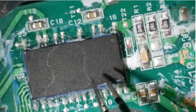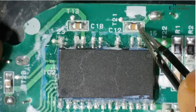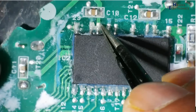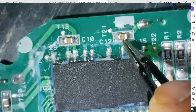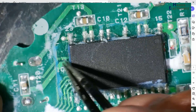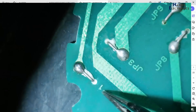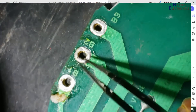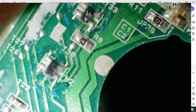High and low side signals are provided to this IC, and this IC is working as an IPM — first phase, second phase, third phase. It will provide three-phase signals on these pins from the underside of this IC. JP1, JP3, and pins B1, B2, B3 — these three pins are connected at the winding ends.